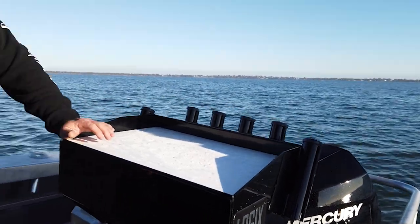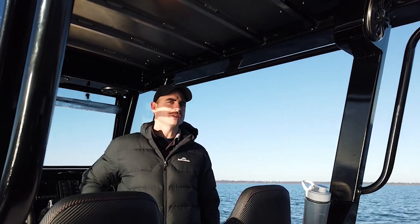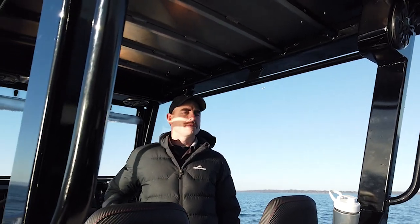Yeah, so we're just going to do a whole shot test now, just to show you guys whole shot. We're going to do a fuel burn test as well, so you can see we're getting about, what was that, James? What we're getting about? 1.6, 1.5, 1.6, yeah. Around 4,500 RPM, which we're very happy with. It's about 26 knots.